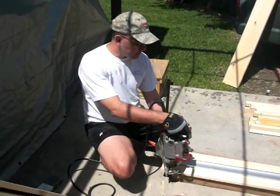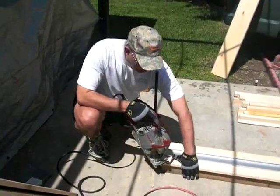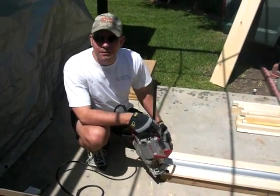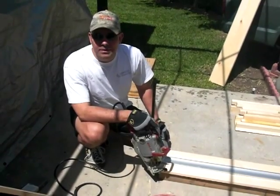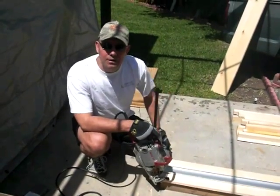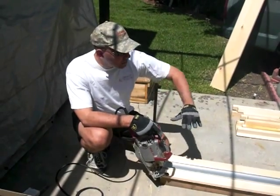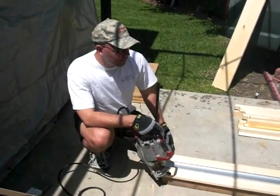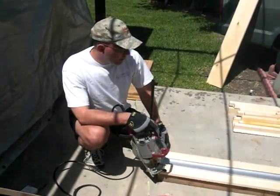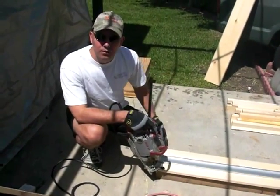Basically I've propped this up with some 4x4 blocks underneath to keep it up off the ground. Obviously you need that clearance height for your blade so you're not hitting the ground. You can also use 2x4 — get two 8 foot pieces of 2x4, cut them up into 4 foot sections and then space those out about 2 feet apart. If you're cutting something like plywood, that's a great platform. Of course you want to make sure you set it out on your driveway or garage floor on a really nice straight clean level surface.